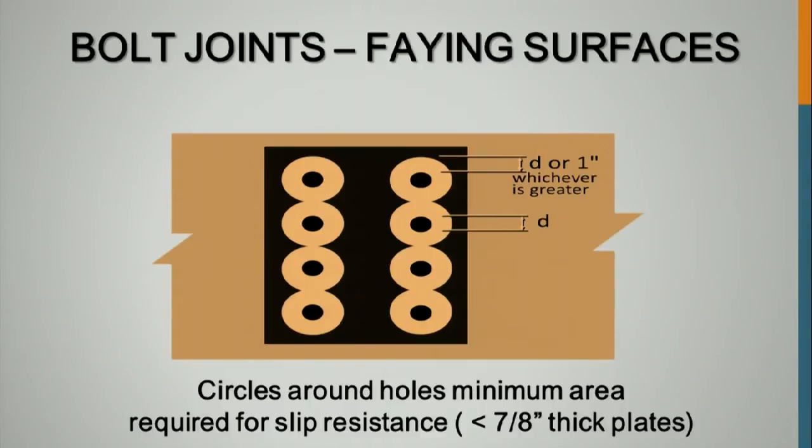It was all erected. The solution was you epoxy putty around the joint, around the connection to seal it, put some vents in it, and you inject it with soft epoxy and plug it so that water can't get in. The bolts were all properly tensioned, but it kept the water out long term for the project. And then you paint the bridge and hopefully it'll last many, many years because it's not going to slip, since you have the slip critical connection.